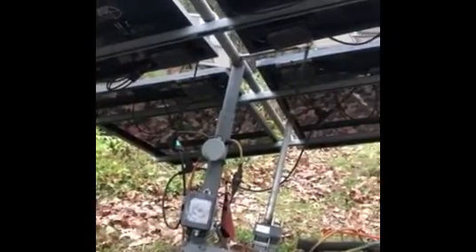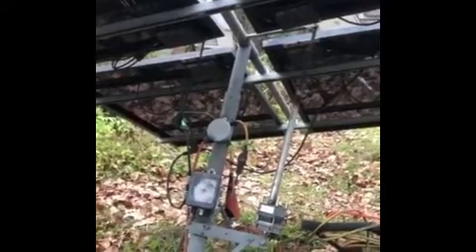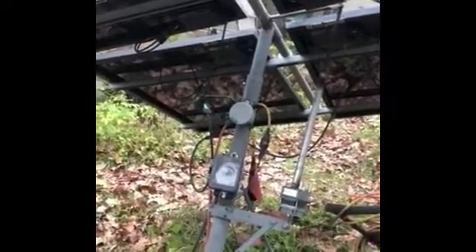The real-time clock is right here. This orients horizontal at nighttime, and at a pre-programmed time it goes east. Then every 15 minutes it moves a little bit to track the sun. I don't calculate the position of the sun — close is close enough, and this works just fine. These are probably the most economically competitive construction costs compared to the other ones, especially this huge one right here.